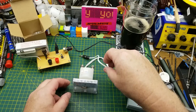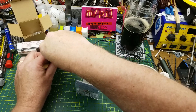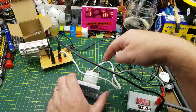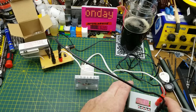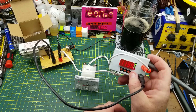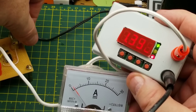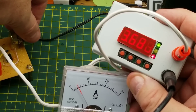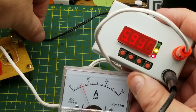I'm going to give this thing a test to see if it's as accurate as anything else I've got. I've put some cable on it — let's hook it up to the electronic load and to my power supply. Negative to negative, positive to positive input, then out to the positive there. 12 volts, going to 6 amps — that's where the load maxes out. Turn that on, set to amps, zoom in — start bringing up the load. There's basically 2 amps and that looks about right. Up to 5 amps — yeah, that's close enough. Max it out at 6 amps. Beautiful. That is going to do nicely when I upgrade my electronic load.